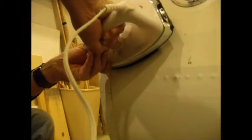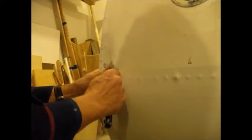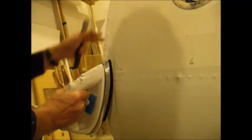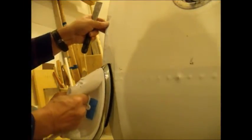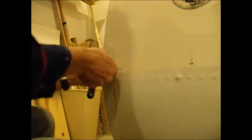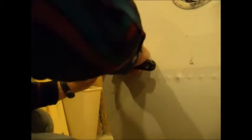As I get in here with my iron, I'm heating up the corner of this tape. I can feel it dragging and sticking as it softens up the Polytone — or Poly-want-a-cracker, you get tired of all the polys. Usually if I get it softened up enough, I can get a corner loose, and once you get that started the fabric is pretty easy to peel. Another thing you can do is go at it with some MEK. Usually, once you get it started it comes right up.